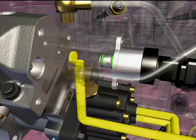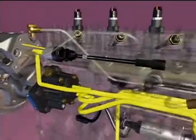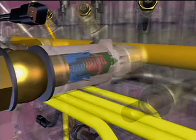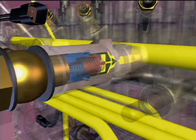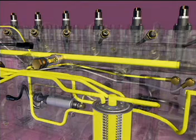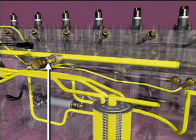Because the actuator for these systems is a normally open valve, any circuit problem — such as an inadvertently disconnected actuator connector — will cause the actuator to open. This results in maximum flow to the high pressure pump, leading to the opening of the fuel rail pressure relief valve. This valve protects the rail, lines, and injectors from any malfunction causing over-pressurization. On ISC/ISL CM850 equipped engines, when the fuel in the rail exceeds the valve setting, the valve opens and fuel is returned to drain.